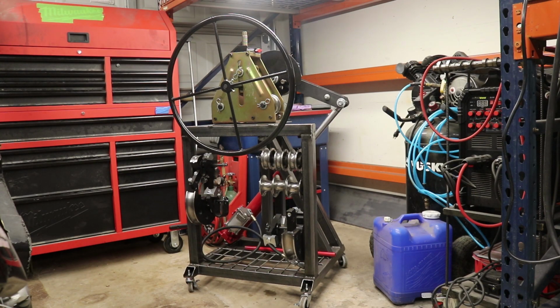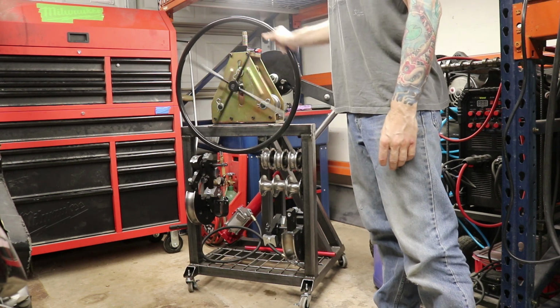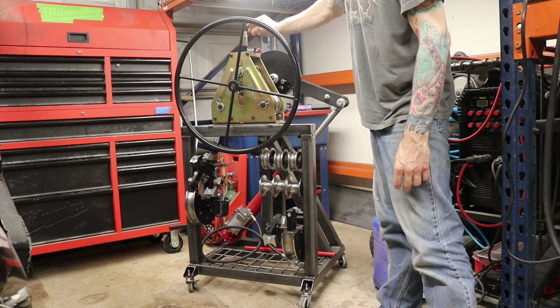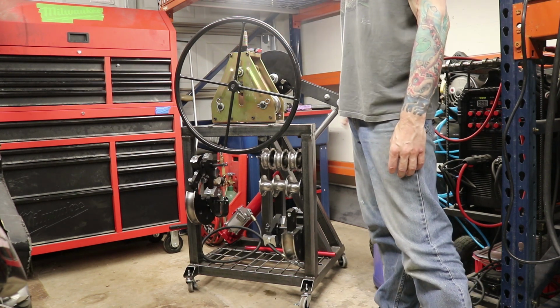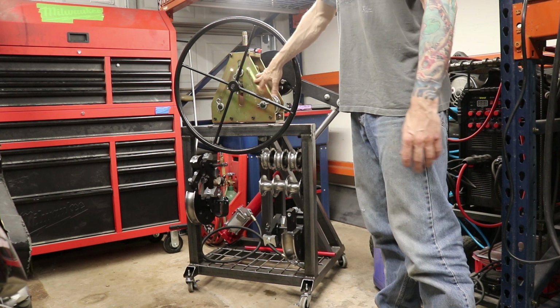I definitely have some modifications I need to do to the tubing roller to make that thing just easier to use. Amongst those modifications I want to do are the electrical attachment. For this guy here, you can do an electrical attachment so that instead of having this manual, you just have an electrical setup here and that will rotate that for you. Other things I want to do is a modification up here where you add in a bottle jack to push this down and apply pressure to the tube. There's also some wings you can attach out onto here, and I'd like to add those on as well. Basically redo this whole thing.